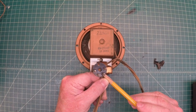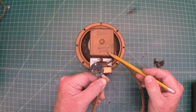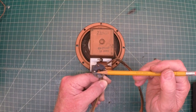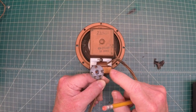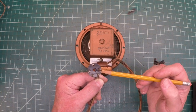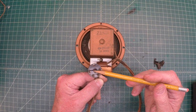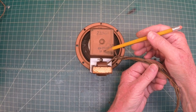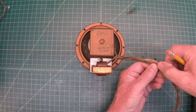To recap: these two pins closest to the center here appear to go to the field coil itself, which shows a DC resistance around 15 ohms. We'll check the inductance of that as well and document it. The two outer pins here — that's where I'm showing open. I need to confirm these leads go back to the transformer. Since I know my DC resistance going to the field coil is very close to what's called out on the casting of the speaker frame itself, I'll go ahead and just take the soldering iron and heat these up and reflow the solder to see if it makes any difference.